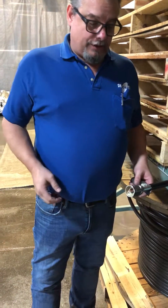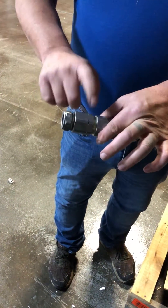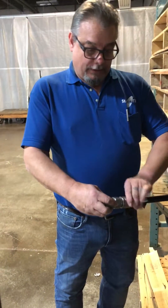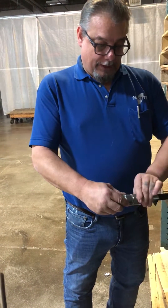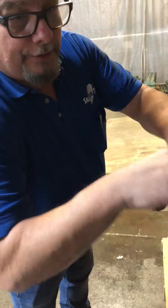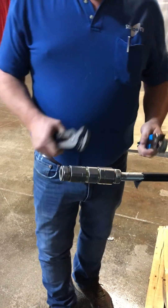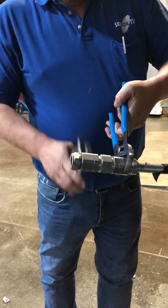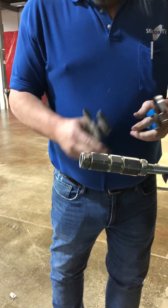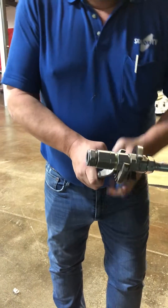Trim this down just a little bit — it should be sticking out kind of like an RG6 connector, maybe an eighth of an inch. Now we're going to put this onto the splice. Don't turn this piece, because if we turn it, it'll grab the center conductor, twist it, and either completely break it or cause distortions. This piece stays put, and we run this nut up here. Grab the big wrenches and tighten it down good.